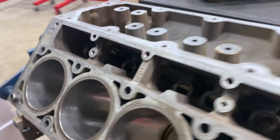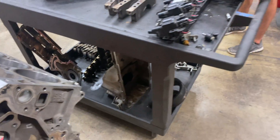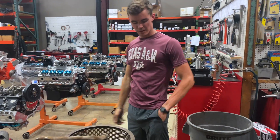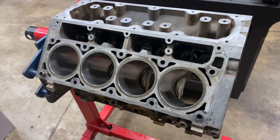Got the block honed for the new pistons. We also put the new springs in the heads for the new cam. Everything is totally cleaned up and ready for assembly. It is 11:14 — I think we started around 5:30, took a break for dinner, then just powered through the night. The dirty work is over. Once we get the pistons in, we can balance the crankshaft and assemble the engine — that's the fun, clean work. Super glad we got it knocked out tonight. See you guys next time.